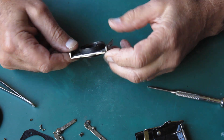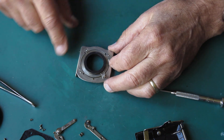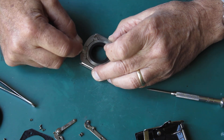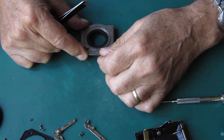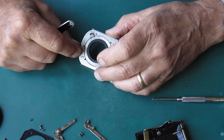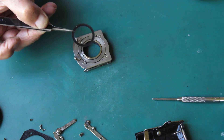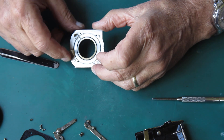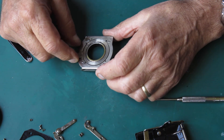Here I've got the inner and outer helical. There doesn't appear to be a hard stop on here, so I should be able to revolve this all the way until the whole inner comes out. What I'm making a note of here is at what point this is hard down - my focus lever comes up against the post at this point. That appears to be a rivet, not a screw. And at that point I'm just about flush - there's a spacer ring, I didn't even know that was a spacer ring. That can go on the back of the shutter.